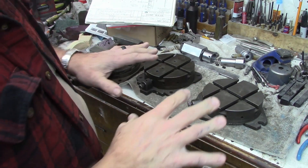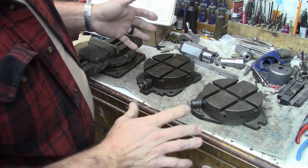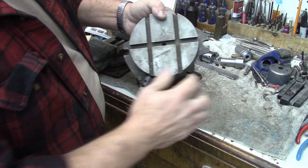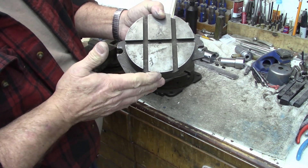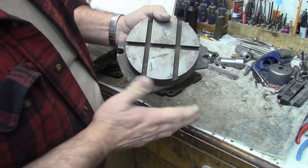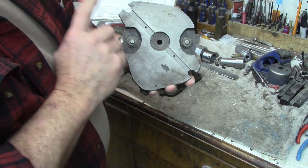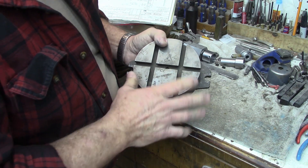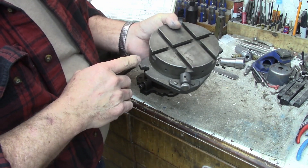Let's break this down into differences that I know right off the bat, and then we'll talk about things that are the same. If we look at the rotary tables: this is a rotary table off of a milling machine and it's only got two mounting lugs on here, and the locking mechanism is kind of offset — I don't remember exactly the degrees. This is the rotary table for the shaper: two mounting lugs, and then it's got the key in the back. The reason it's set up this way is because there's only one key slot down the center of the table on the milling machine.